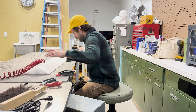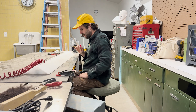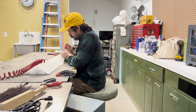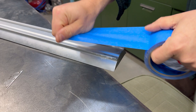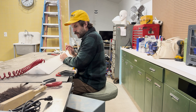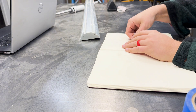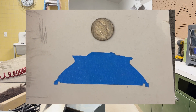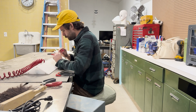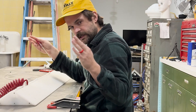I had a design I was really excited about, but I needed to figure out how to get the geometry of the light fixture dialed in so that the brackets would fit securely onto the light. I didn't use any calipers or fancy 3D scanners. I just got out some good old-fashioned painter's tape, covered the end of the light, peeled that off, and cut it carefully to outline the profile. Then I put that on a piece of paper next to a penny or a nickel as a size gauge, and traced that in CAD. I knew there'd probably be a little shrinkage with the material, so I oversized it visually. I got it right first try, but there was one little problem.